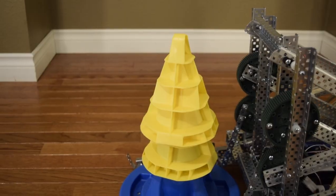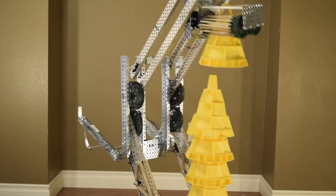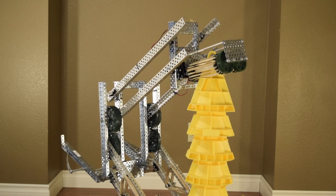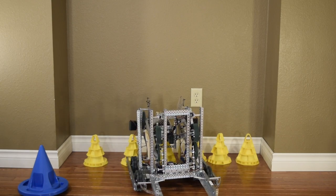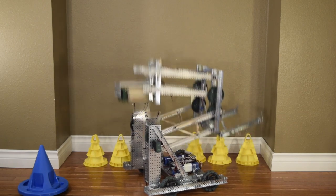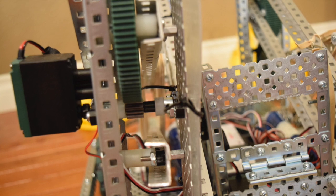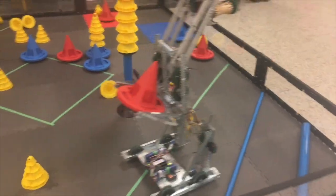The robot was not perfect. The robot's motors would sometimes lock up — VEX motors will stop working for a short period of time if they are being used too much, and nearly all of our motors were used way too much. The cone intake would lock up and not drop cones, the lift would lock up and stop lifting, and sometimes the drivetrain would even stop. This was the worst flaw with the robot, due mostly to the fact that our entire robot was steel — we barely had any aluminum, and what we had was nearly all used on the lift arms. This could maybe have been helped by using different gear ratios, but by the time we thought of that there wasn't enough time. Even with all these flaws, I'm super happy with how things turned out. This was the first year the program made it to state, and that's awesome. Thanks for watching.